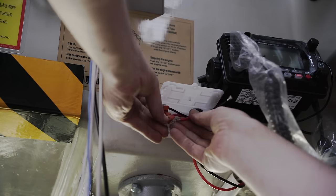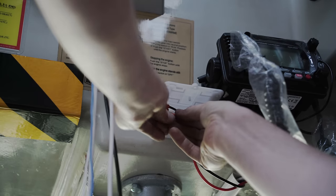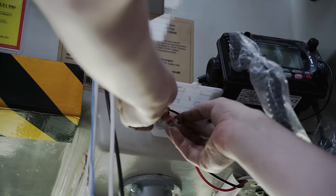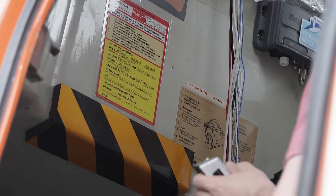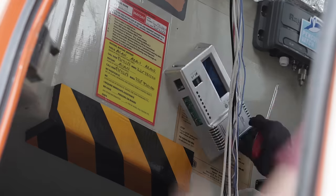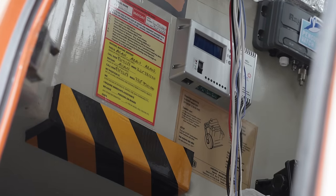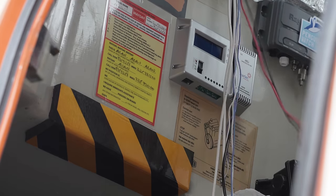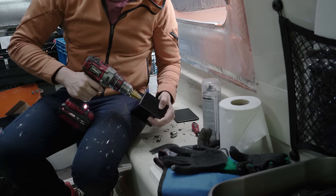Now, to some of the associated wiring just below the driving console. Two critical items of equipment, the VHF and AIS, get their own high quality 24-to-12 volt fuse regulator, and then a little distribution box so some electricity can head to each unit. Then up goes the dual battery charger that's designed to work with Alan's wind turbine. I'm thinking of having this as a swappable charger with two plugs that can head to whichever batteries are in need — house batteries, the crank battery, portable ones, whichever. I also need a little box to contain some buttons and switches, a little regulator and a fuse or two, so I turn to my new favourite bit, the step drill, and make some holes.